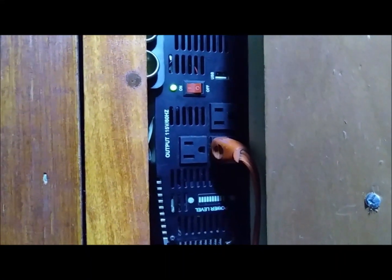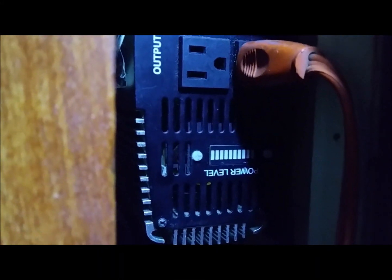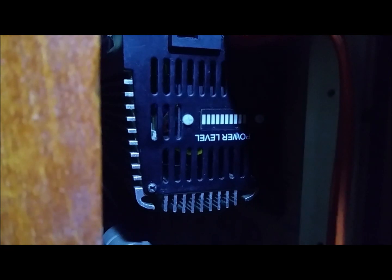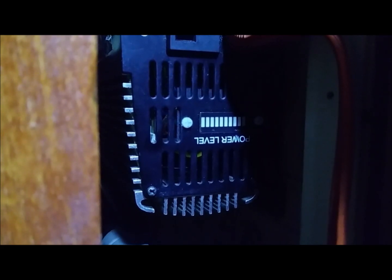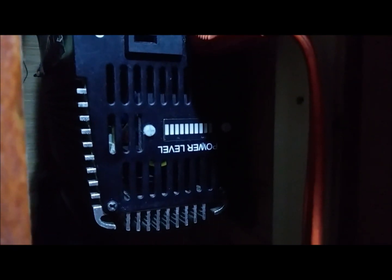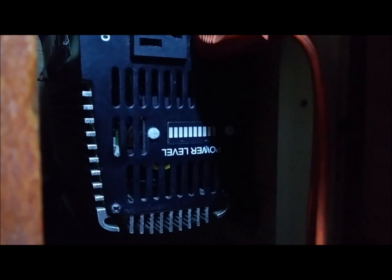This is my inverter. The air conditioner is currently running — I have it at a low temperature, so the fan is only running right now. What I wanted to show you is how much that starting capacitor helps with the initial surge when it kicks on. See that power level there? You actually don't see anything right now, and in a minute you'll see it pop up, and then you'll see its max peak, followed by what its running consumption is. It's pretty impressive what the starting capacitor did. It used to take about two seconds of maximum power for starting, and now it's just a little blip.